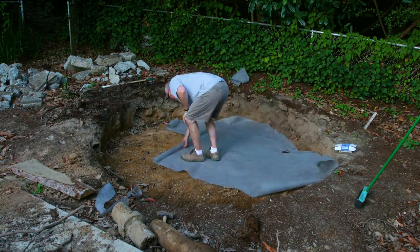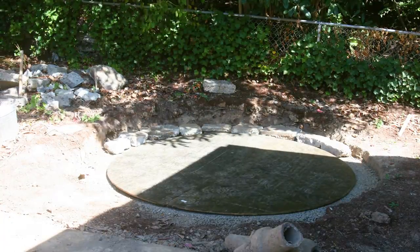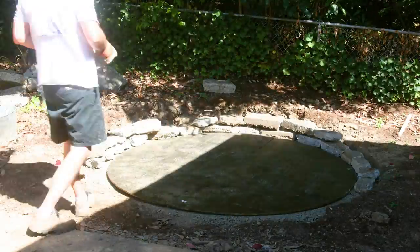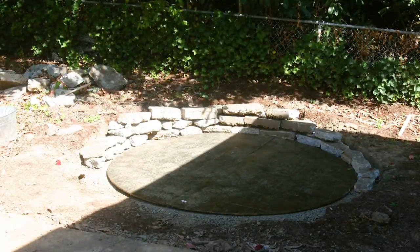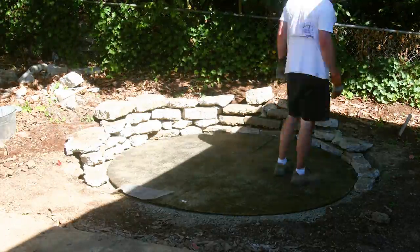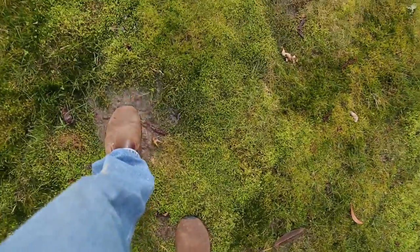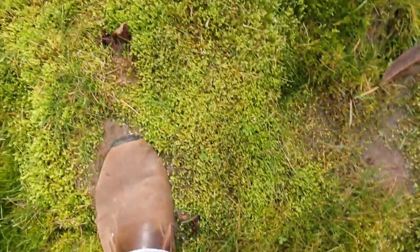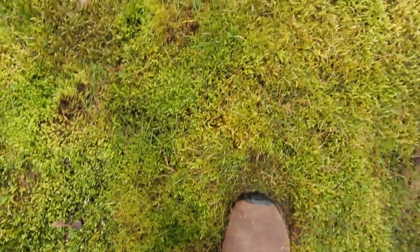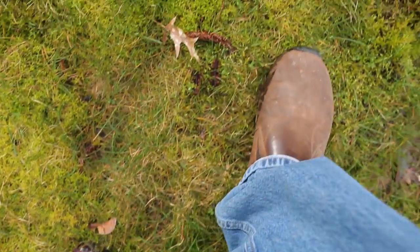I made a spot for the tank by digging out a circle, filling it with gravel, and compacting the gravel. Then I laid a sheet of pressure-treated three-quarter inch plywood on top of the gravel. Where the water from the shop roof comes out in the yard, I've got kind of a mossy swamp, which really needs to be solved. So the reason for the tank is both storm water management and to save water for the garden in the summer.